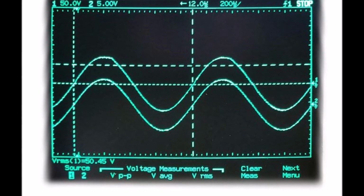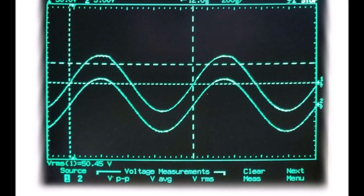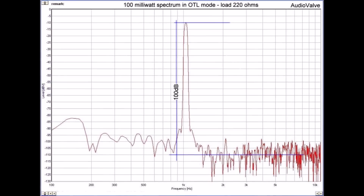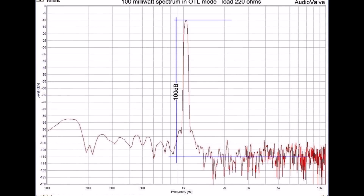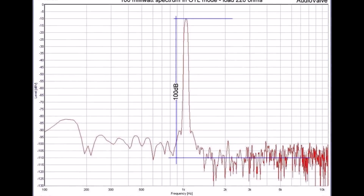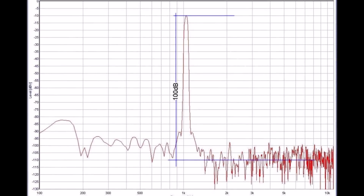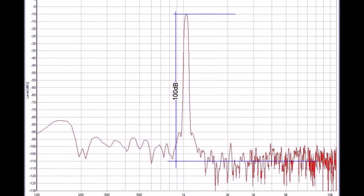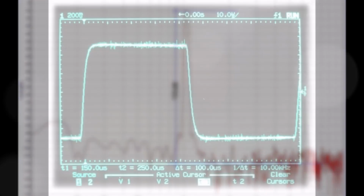Since the tube circuit outputs a good 12 watts per channel, the Solaris can also be used as a classic integrated amplifier. Solid speaker terminals are available. To do this, either the Stax mode or the IMP mode, quieter, must be selected and the balance control pulled out. Then the speaker outputs are wired.